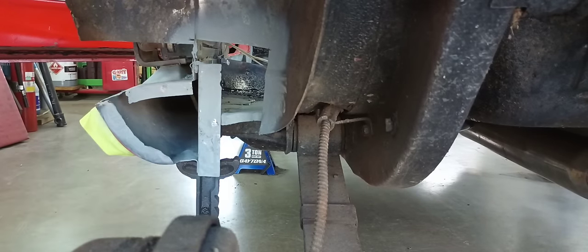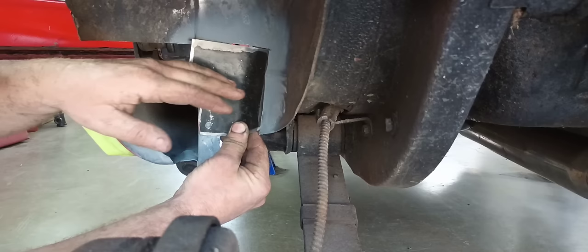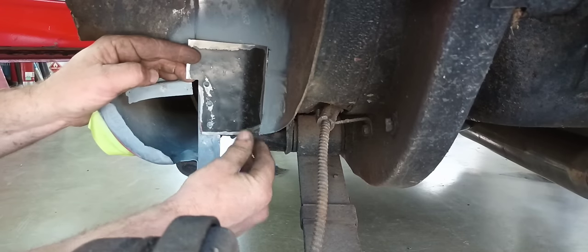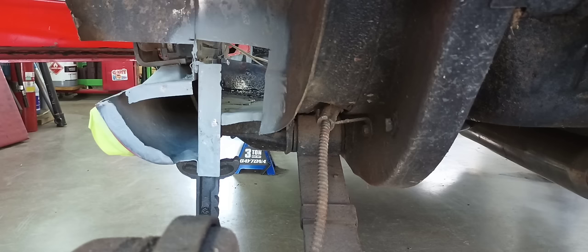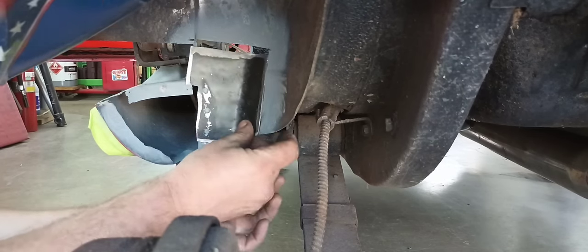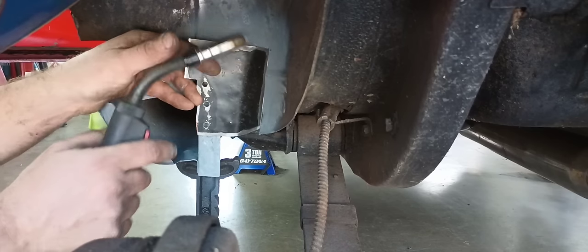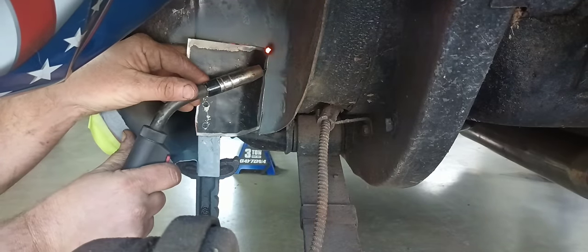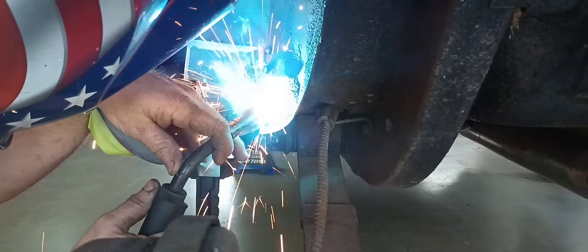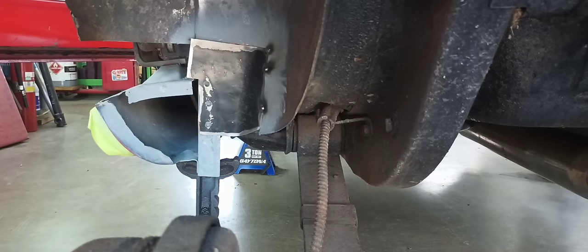I think I've got our panel close to fitting here. I'm going to have to dolly it while it's in the car and as I weld. But I can first start with this edge right here and this up to this bend right here, and that'll allow me to hand form it. I also went ahead and drilled plug weld holes. Once you get it tacked, you should be able to push it around like this. You may have to get a little downward tap to get it flush.